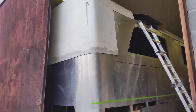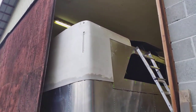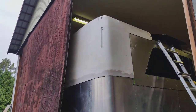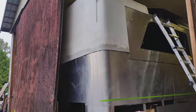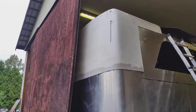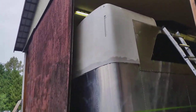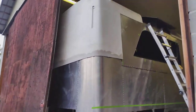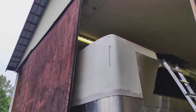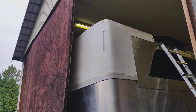The cap's pulled down into place, sealant's in there, just going to start doing some riveting. That green tape I've got run along the bottom is just a reference so I knew how far to pull it down so it's even on both sides — went from the marker light mount up at the top down to that green tape on both sides. Hopefully they're at the same height, because otherwise the cap's going to be crooked. Seems like it's pretty close, so I'm going to start riveting.